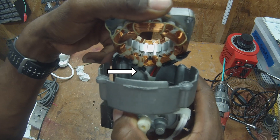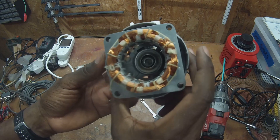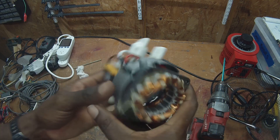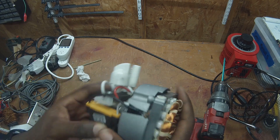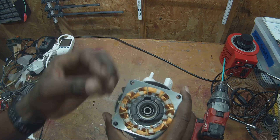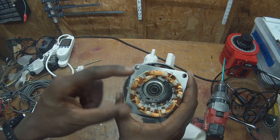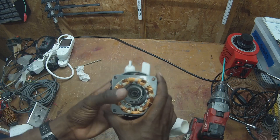You can see at the bottom there are three wires coming in, and those go around and are wired directly to different coils. So it looks very similar to the shaded pole motor, but it's not. As you can see, there's a capacitor right here on the side. That lets me know that there's a starter winding in here, but it looks like there's nothing to disconnect the starter winding, so this is most likely a PSC — Permanent Split Capacitor Motor. Having a separate starter winding with a capacitor offsets the magnetic field just enough to give you the starting torque. The reason that all motors aren't like this is because the amount of starting torque you can get using this method is very low, so it's great for a fan. There you go — two examples of motors that can be run with voltage control.